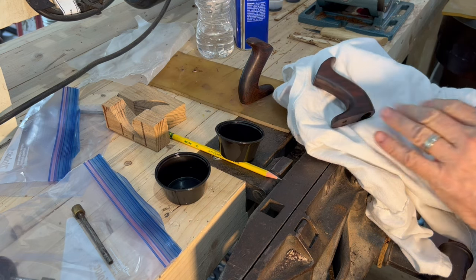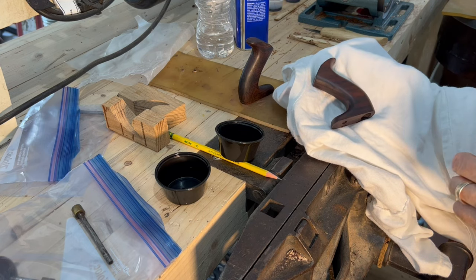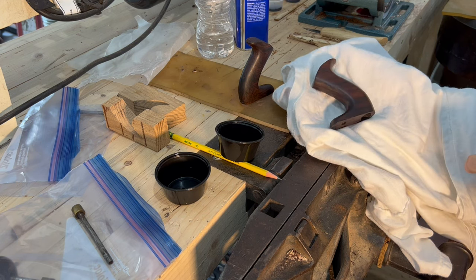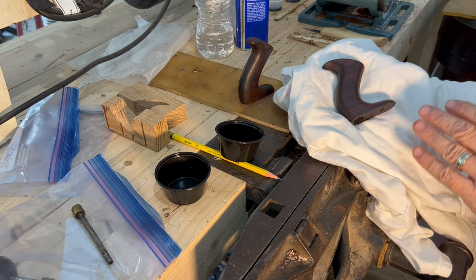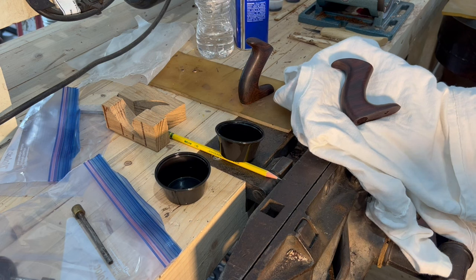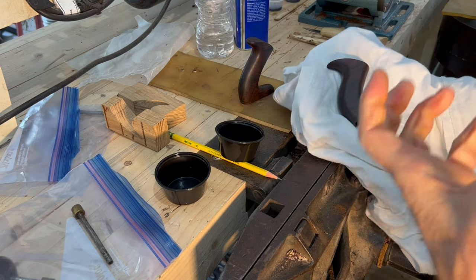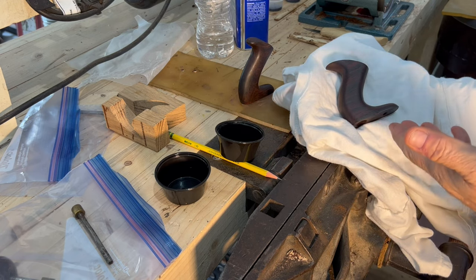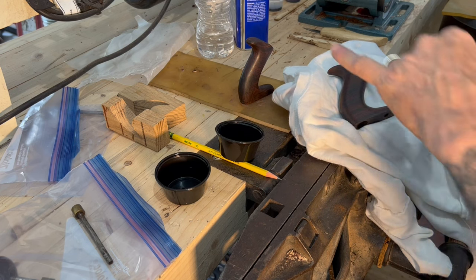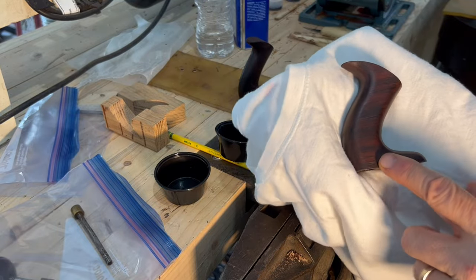And then I lightly touched it with some automotive grade wet dry, like a 5 micron paper, just to kind of burnish it in and make sure that we didn't upset the original finish. I went back and applied a paste wax, which I do with all of my totes. And I just love a satin, a little more tactile feel. Again, I doubt these are users, but it's the same finish for me always on everything I do. So both of them got their fill-in, both got their paste wax, and it's still matte finish right now.